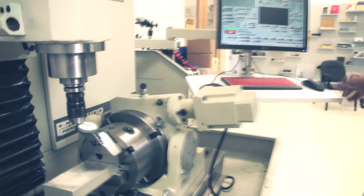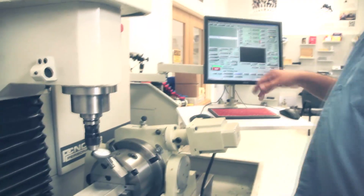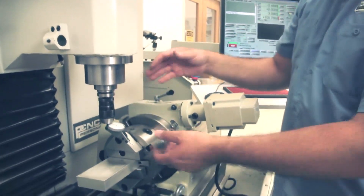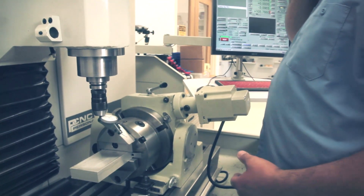I've centered the axes of the machine to the center of the chuck — I did that already. I just swept the outside of the chuck; I knew the chuck was running good, so I swept the outside. That's what I'm going to call zero.